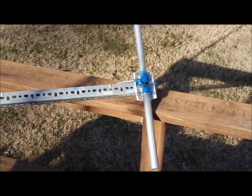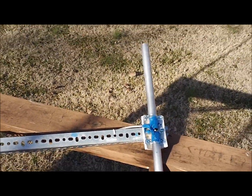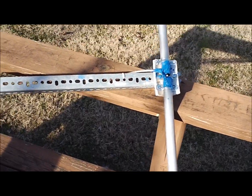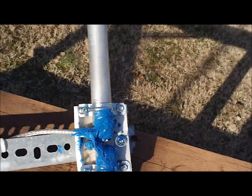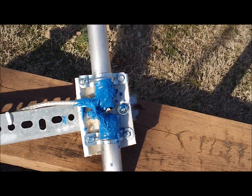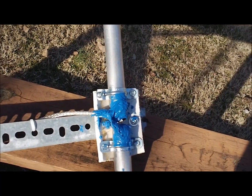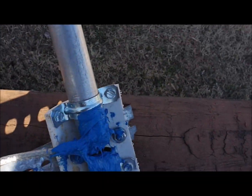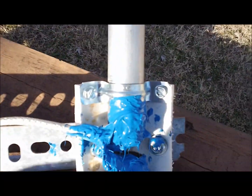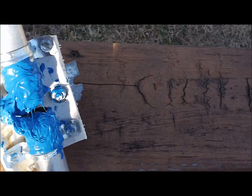The first part of that video clip was from summer — I made her little scanner dipole. Here it is in winter; it's now January of the new year, and I finally have it all done. I got the coax hooked up. There's 3M tape underneath there, and then I put blue RTV sealant over it. It's just a little dipole — my first time to make a rigid one like this. It turned out okay, I guess. That's just some PVC pipe I cut a section out of to make the insulator.